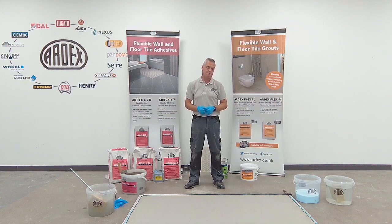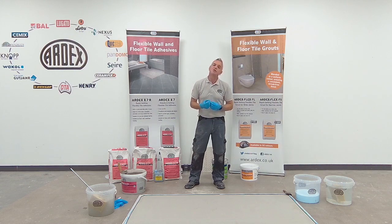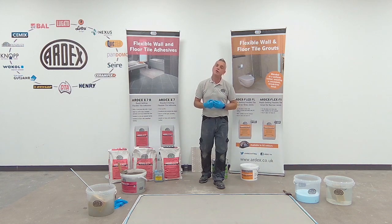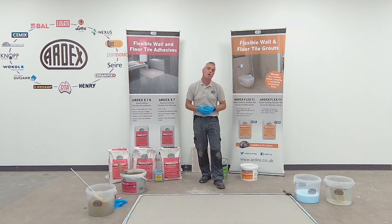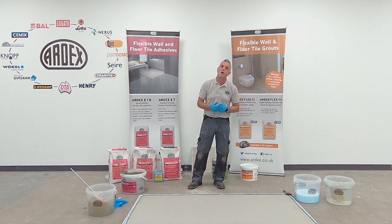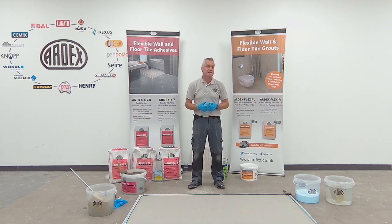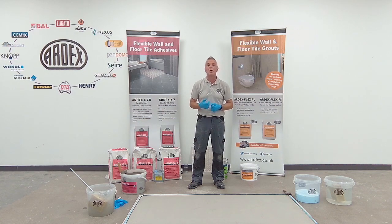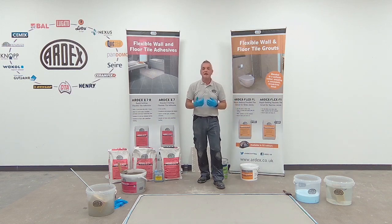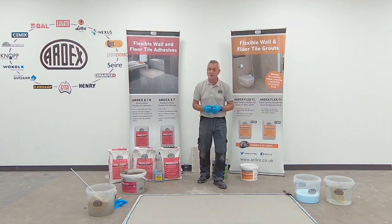this can apply internally as well. So when you're looking at substrates that are quite porous, you may need to consider the use of priming. We talk about priming on a day-to-day basis anyway, but also if you don't normally need to prime that surface, you might want to actually consider priming, but follow the ARDEX technical data sheets on all the primers that we have within the range as to the dilution rate or the type of product according to the substrate you're going onto. But with regards to priming itself, for internal use, you could use products like P51.